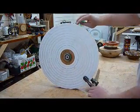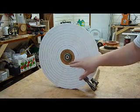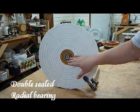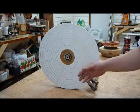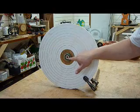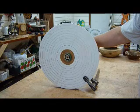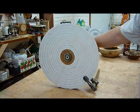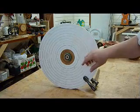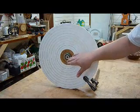Probably the most important aspect of this whole system is this right here — this is just simply a radial bearing. Again, you can find it at almost any hardware store, or certainly on the internet, or any kind of industrial supply place. Now, this bearing had an internal diameter of about 5/8ths. The lamp rod is 3/8ths. You can certainly get a 3/8ths ID bearing if you'd like, but this is one I already had, so I simply took a piece of MDF, turned it to fit inside of that, and epoxied it in place.